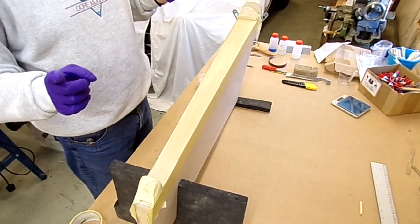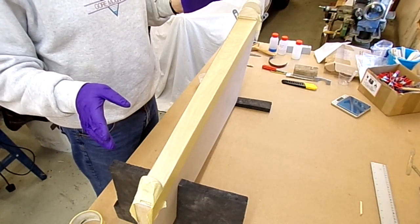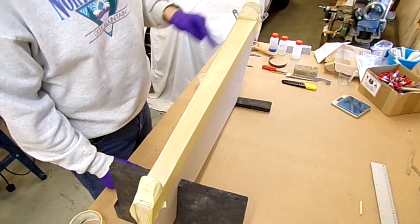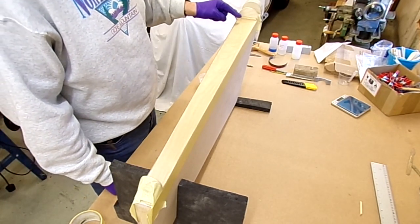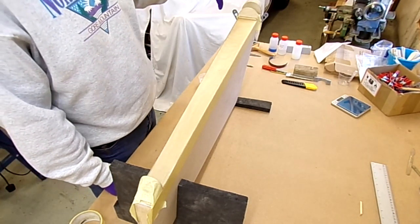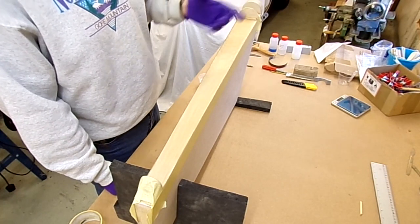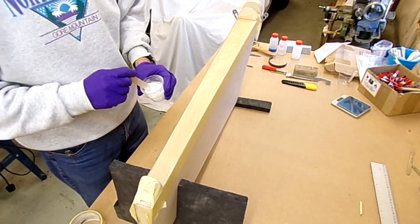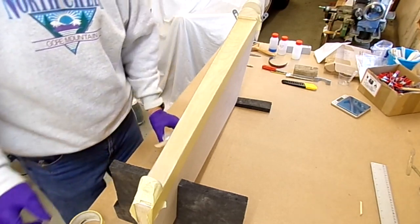Okay then, so state of play. Just about to do the bonding of the leading edge on. I've run resin along this leading edge here and then wiped off the excess instead of having varnish on here. And I've mixed up some micro balloon and I'm now going to butter up bits and pieces.